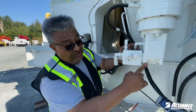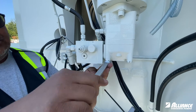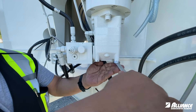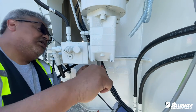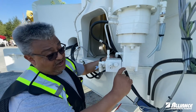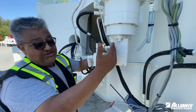One way to check is if the head of the bolt is missing, or you put a regular wrench in place and try to move it by hand. If one of the bolts came loose — because it could break up at the top so the length of the bolt is still holding it — if it came loose, you can change those bolts.